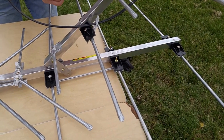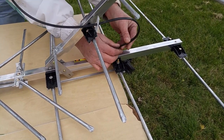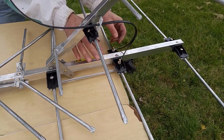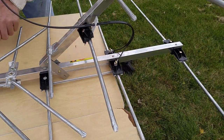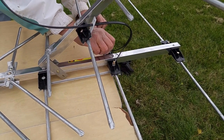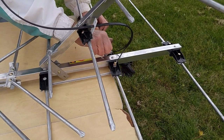Now place one washer on each post as before. Attach the ends of the twin lead to the post. Place one more washer on each post as before. Then attach one nut to each post as shown.